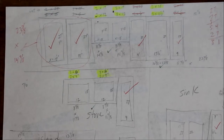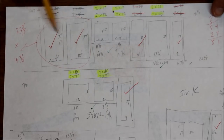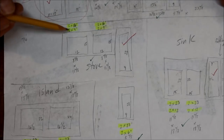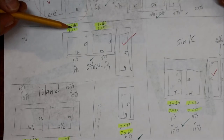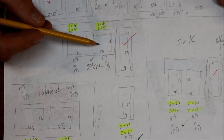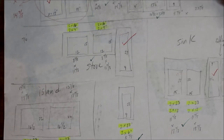Something that's really essential is to come up with a diagram. I just did a rough sketch — I didn't have to make it fancy or put it in the computer. I did a sketch of the cabinets I needed to do in the kitchen and their different locations, so I could have a checklist of what I had done and what I still had to work on. I made notes of the sizes I needed for each piece, including the rails and stiles, and the size of the quarter-inch hardwood finish-grade plywood I'm using.